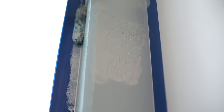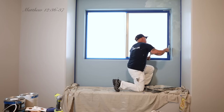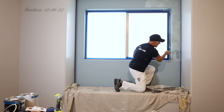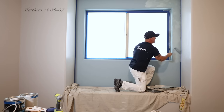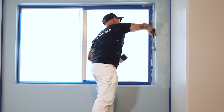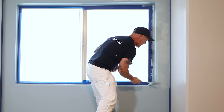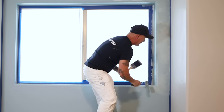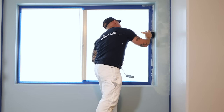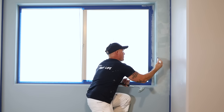I'm kind of excited to see this — this was a color I chose for this bedroom and I think that color is absolutely amazing. It's really important that you random roll and random brush when you're applying it. You don't want anything to be consistent with these metallic suede coatings. Everything is done randomly so you don't see any type of pattern.